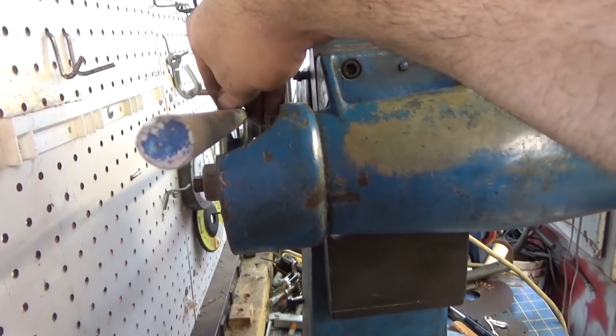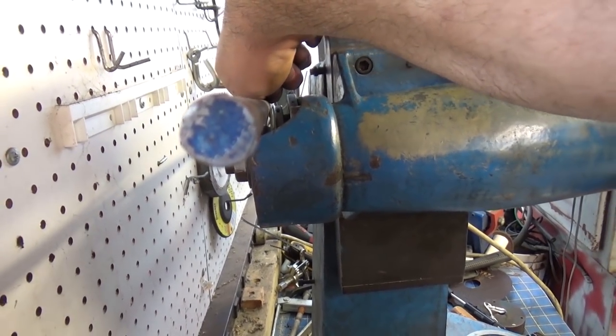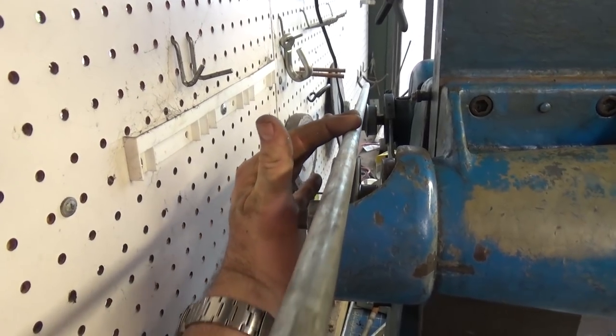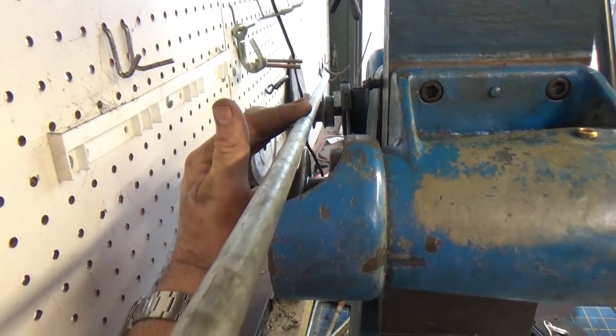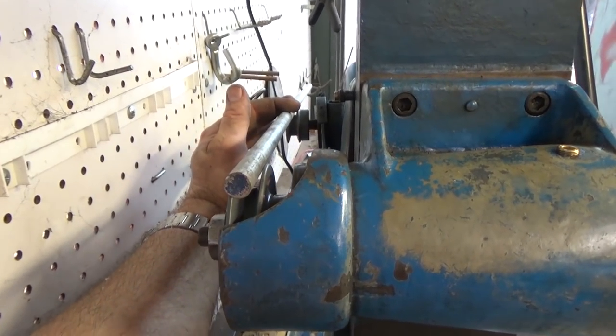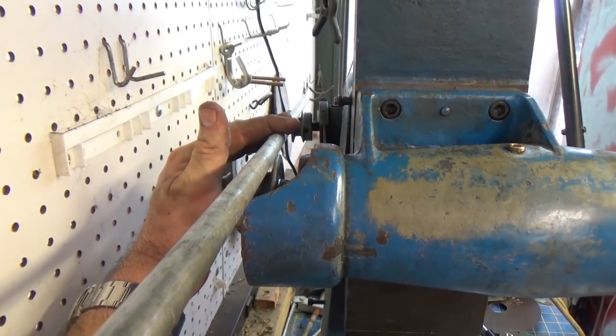It's sort of hard to do this. But if you hold the pulley, it's really hard to get the shot here. It only turns ever so slightly. I don't know if you can see that. But if you get a straight rod between two pulleys, and if they're not aligned, you're going to see them start to twist. And I'm trying to keep pressure on it and let it go.